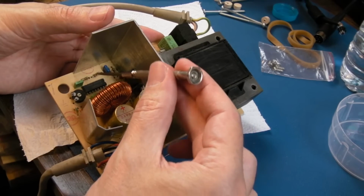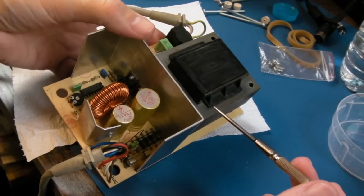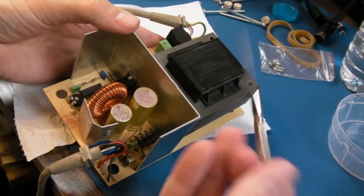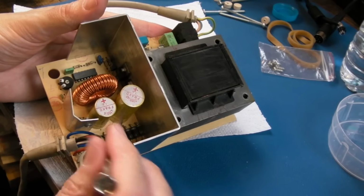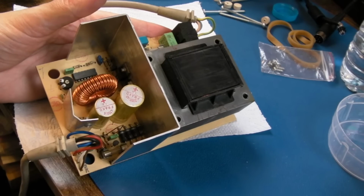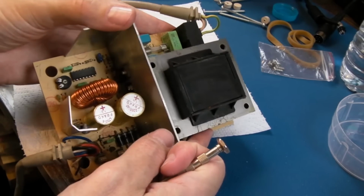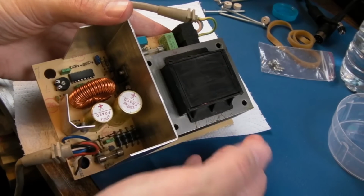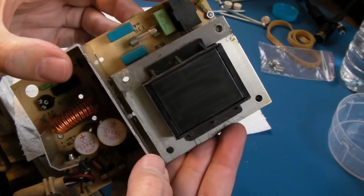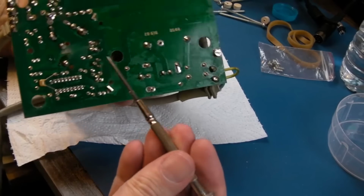But it's going to be this IC here and these 3 semiconductors, because the AC obviously is easy to just pass straight from the transformer, and that's what the bridge is for here and stuff, and the fuse is all for the 5 volt side, I think. And obviously there's a few transistors, there may even be an SCR or something there. But, you know, nice big chokes and things like that, nice big inductors. Obviously it's got a choke and X and Y class caps and stuff on the input side there as well.